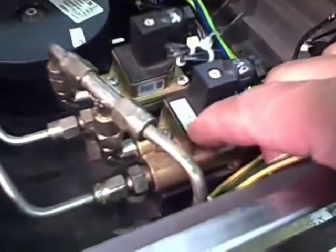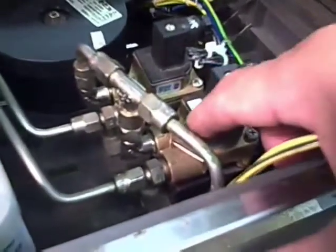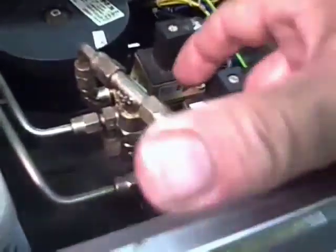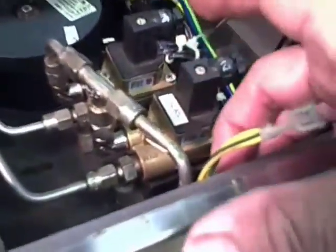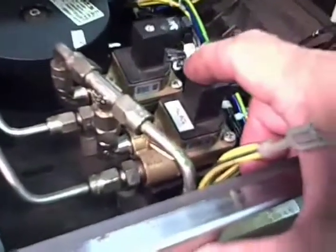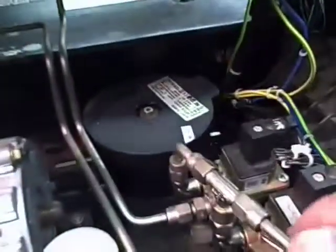These volumetrics, or micrometrics, have a little vane inside which water squirts in from one side and spins the vane. There's a magnet on top of the center of the vane and a sensor that counts how many times that magnet passes through it — so it counts the number of rotations and sends a digital pulse to the computer.